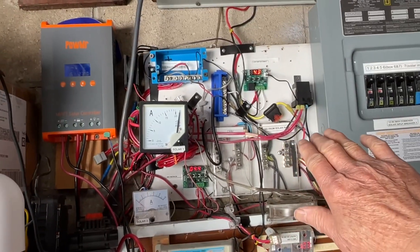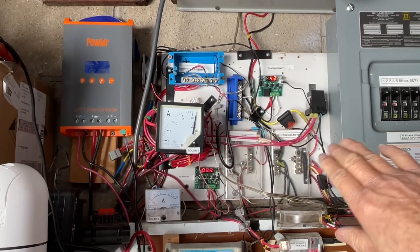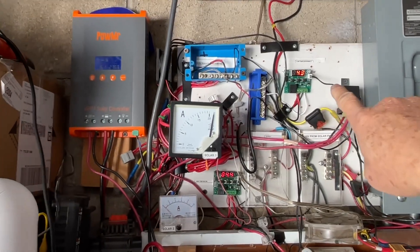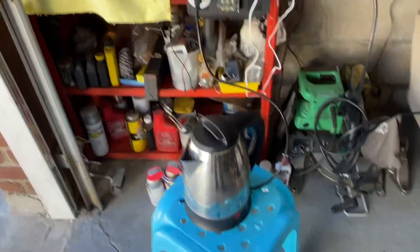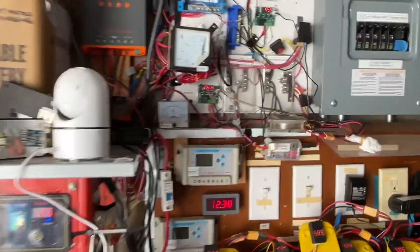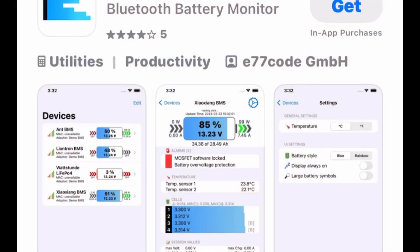I have this set up in the garage. Normally before 9 o'clock it's still freezing and it won't charge, but after 10 o'clock it starts to warm up — right now it's 4.3 degrees and everything is working. I think you should have a low-temperature disconnect; that would protect your battery system better.